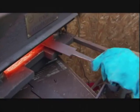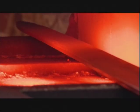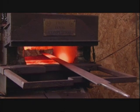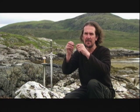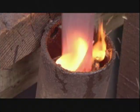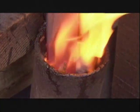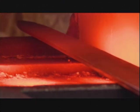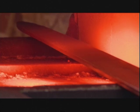Back at the forge, the two most important steps — hardening and tempering — now begin. You reintroduce the steel into the fire, bring it up to a bright cherry red, and there's a particular peak when the steel will be ready — the lattice within that steel will be open to being shocked. Plunging a red-hot bar of steel into oil, you'll get a flare-up of flames and smoke, and it'll shock the steel into hardening very, very quickly. You'll end up with something more like glass — if you took a hammer to that steel afterwards, you could tap it and it would shatter. With the shock therapy over, the blade goes into the forge one last time for tempering — creating a compromise between that hardness and the flexibility you're looking for without losing too much of a cutting edge.